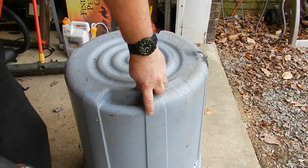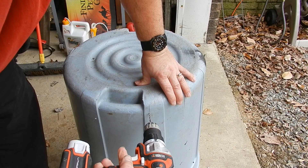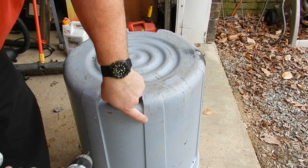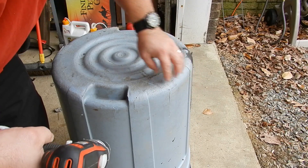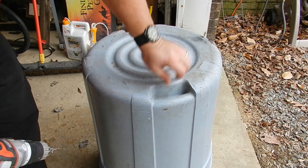I have a new crack right here that I've found, so what I'm going to do is drill at the end of it. What that does is it stops the crack from running any further. You want one hole at both ends — that's what you want to do. I already have it on this one. Spinning around, I'm looking in the creases here for any more cracks.